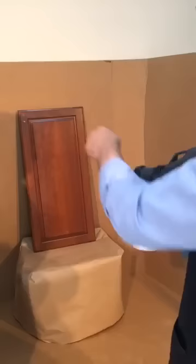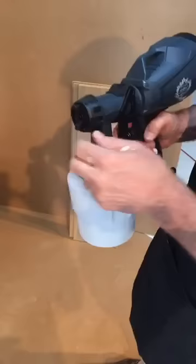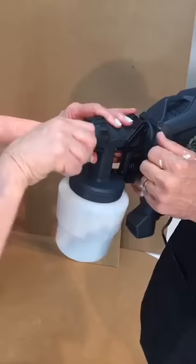Okay. Also, on your air nozzle, you can turn this two different directions. If it's vertical, then your V is like this. If I turn it this way, my V is this way. So it's totally opposite. So I just want to make sure that I understand this. If I'm turning it horizontally, my spray is actually going to be vertical. Now my V will be vertical. And if I turn the nozzle the other way, it's actually going to be the opposite.